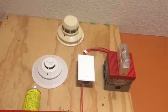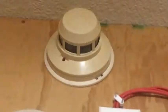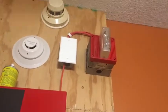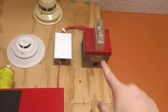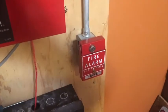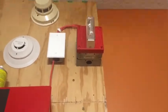The setup is a little bit different today — I have a two-stage setup. What's going to happen first is that I'm going to activate the 2400 and it's going to set off the first stage, which is zone coded. Since everything's on zone one in the panel and the programming, this will do a pulse every couple seconds. Then I'm going to pull the pull station and it's going to switch over to Code 3, and the strobe is going to activate. So let's watch it.